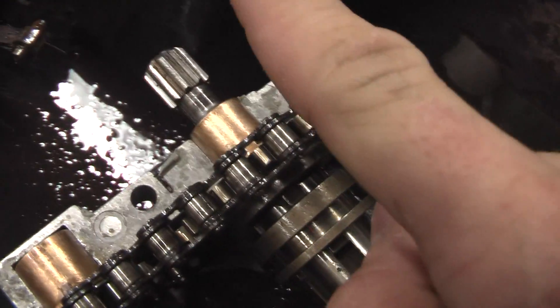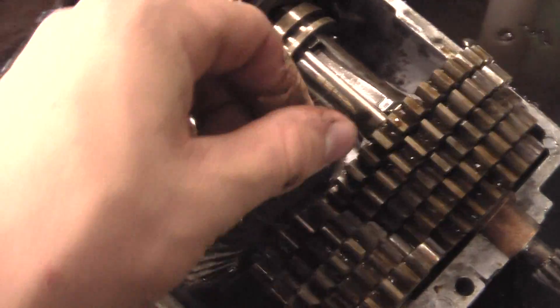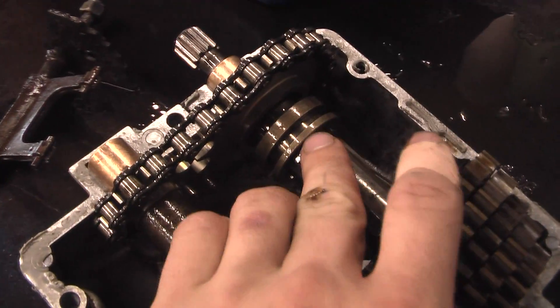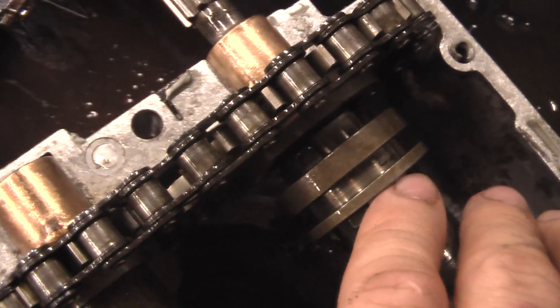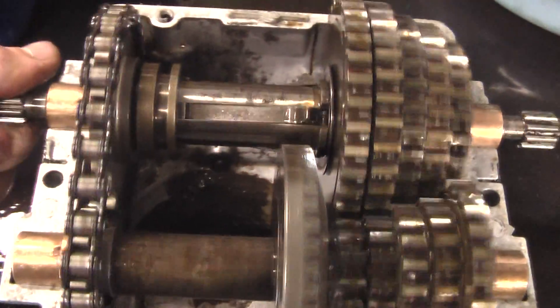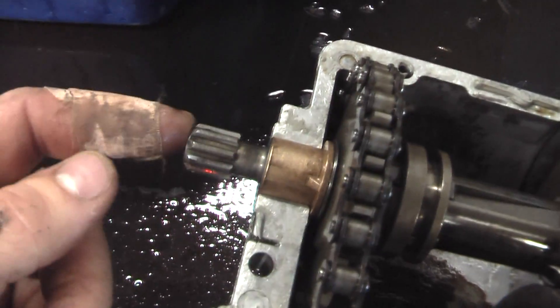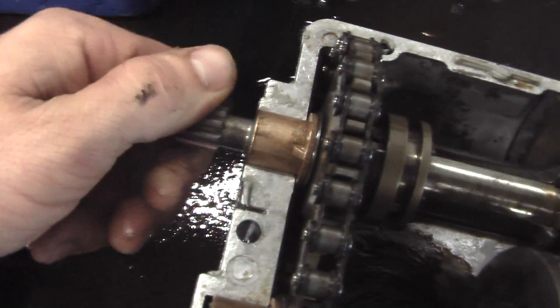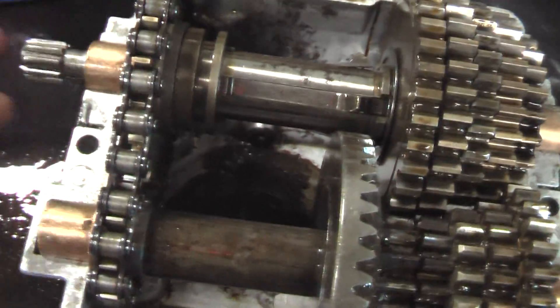Right now it's in neutral. So when you select a gear, you move this piece to the right to go in the forward speeds, or to the left to go in reverse. Let me put it in reverse real quick. This piece would be spinning here, and as this piece is turning you move the shifter into reverse. When the parts line up, this piece slides over like that and then it locks in, as you can see. Notice the ratio. When this piece slides out, this is the piece which goes up to the tires. So as you can see, we've got nothing going to the wheels right now. When that piece moves in, now we've got something going to the wheels.